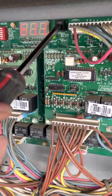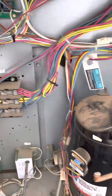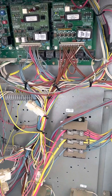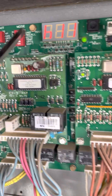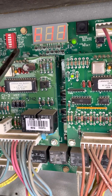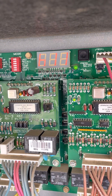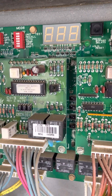I'm going to go over here and shut it off, because obviously they do not need heating right now — it's about 80 degrees here in Texas. So that is how you put a Lennox unit into test mode, and then to go back to regular operating mode, we're going to push the dip switches back — shift them back — and then we're back to normal operating mode.